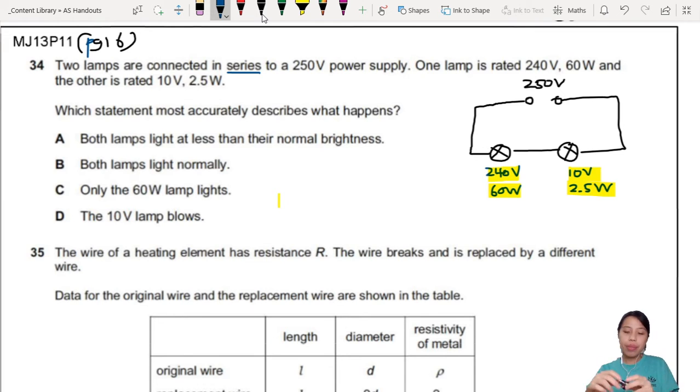If you have a torch light, your phone light, or this kind of baby light bulb — you'll use these a lot in labs. Really tiny little fella. On light bulbs, you can look at the body of it to find the power rating. This one says about 2 to 3 watts at 6 volts. So if you feed it 6 volts, it will give out 2 to 3 watts of power.